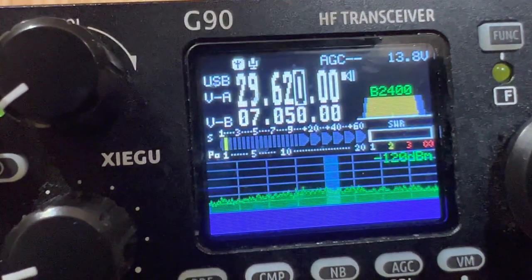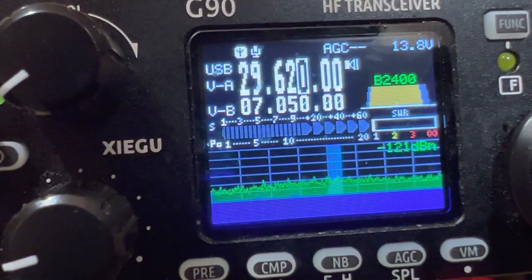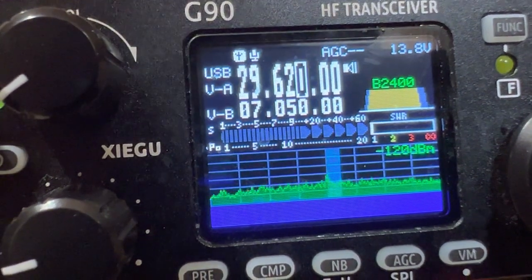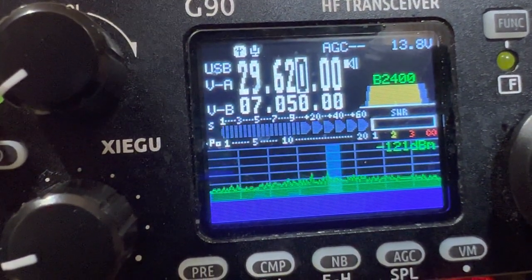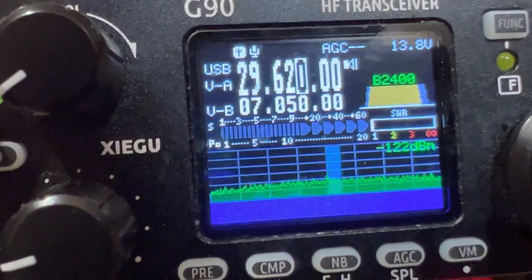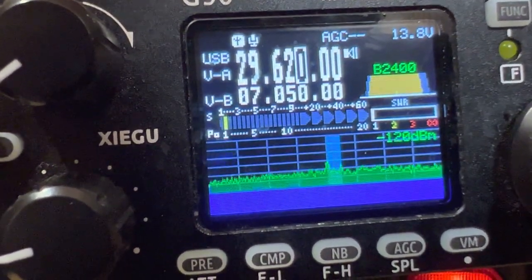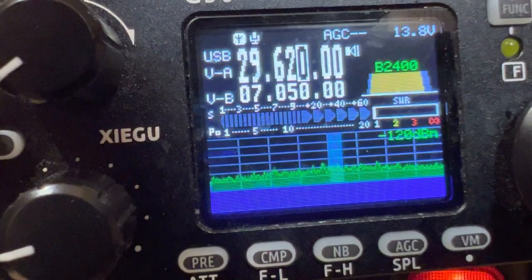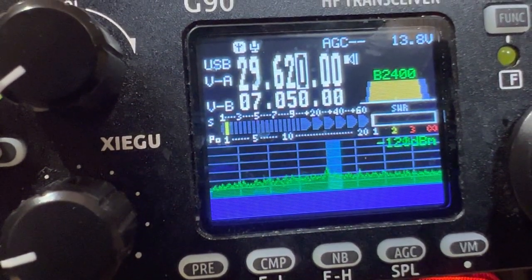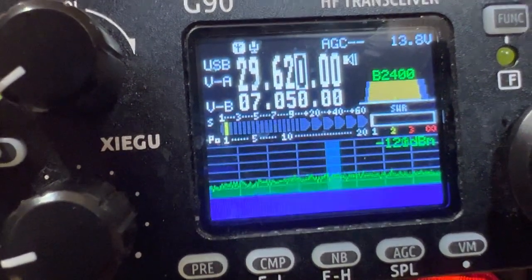It can a little bit. Like if someone can't hear you very well and you bump up from 10 watts to 20 watts, it can help for sure. But probably not by a lot if you think about it. And not only that, 10 to 20 watts, it's not that much of a difference when it's only a half of an S unit, okay? And 5 watts to 20 watts is an S unit. And 1.5 watts to 5 watts or something like that is an S unit. So if you're 5.9 on 20 watts, you'd be a 5.7 on 1.5 watts.